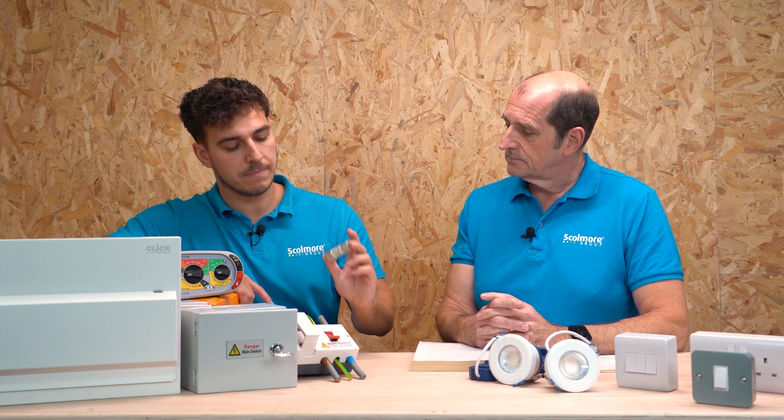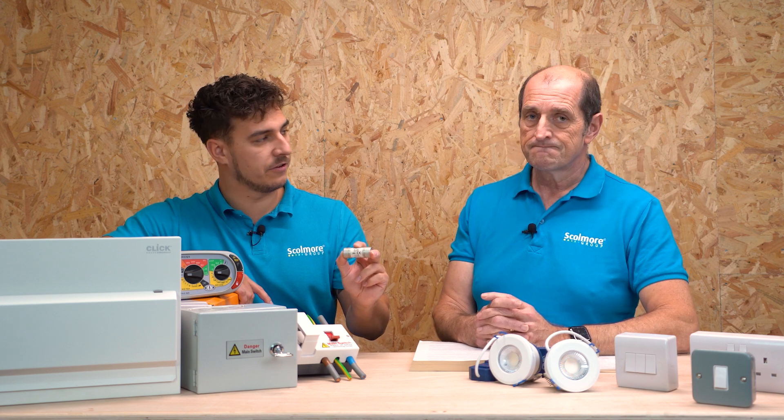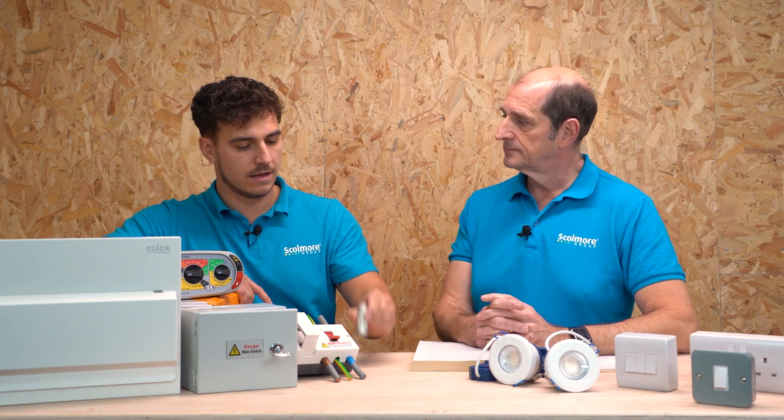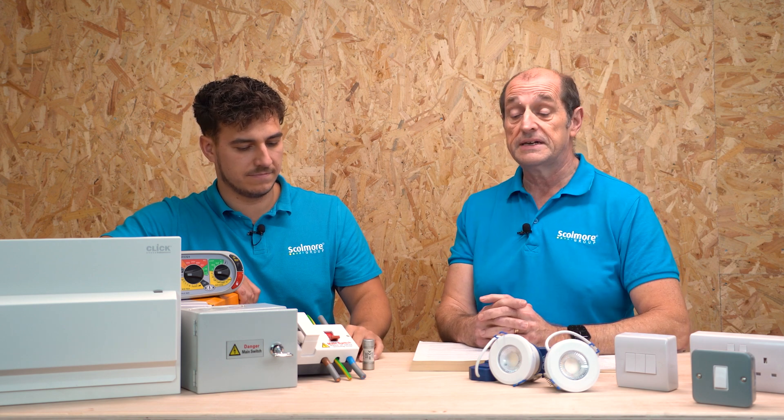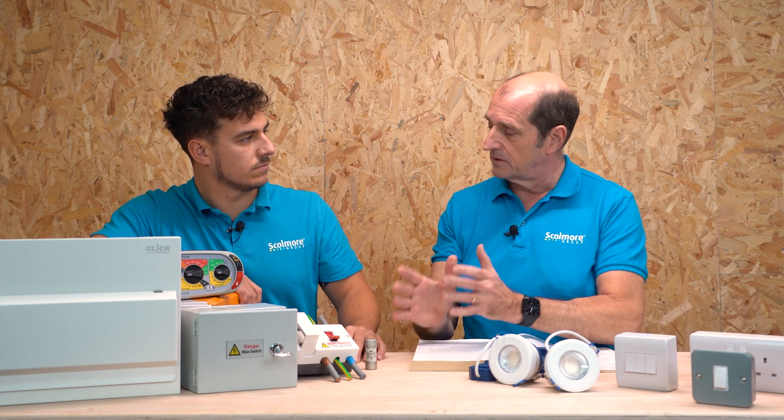Before we move on to the regulations, my concern is the selectivity. We've got an 80 amp fuse here which comes with the product. But if we had a 63 amp at the cutout and then 80 amp here, what's the point? Well, we have no control over what the DNO puts in. In a sense, put that to one side and ask yourself: is what I want an 80 amp fuse for my connected load? If that's the case, put an 80 amp fuse in. Just because it's more likely the DNO's fuse will operate before ours is a separate issue — selectivity goes out the window to a significant extent, and you're not guaranteed that both wouldn't blow. But we put aside the issue around the DNO's fuse and just concentrate on making sure we're in control of our cables.